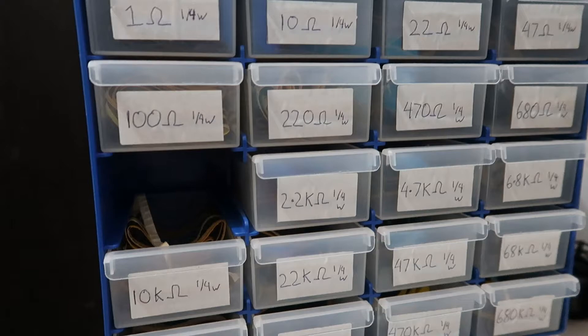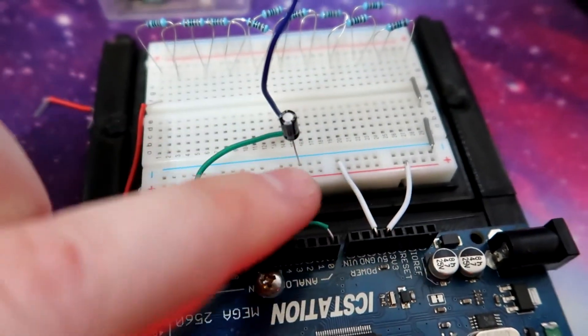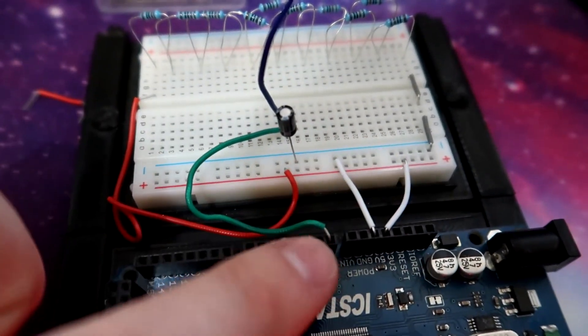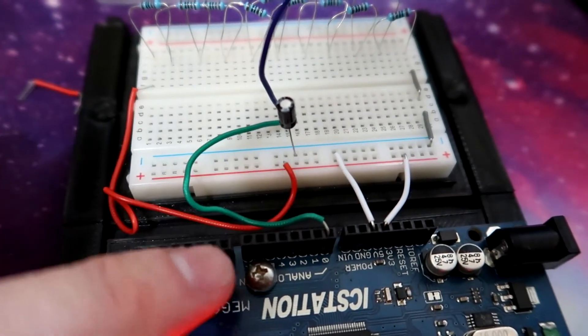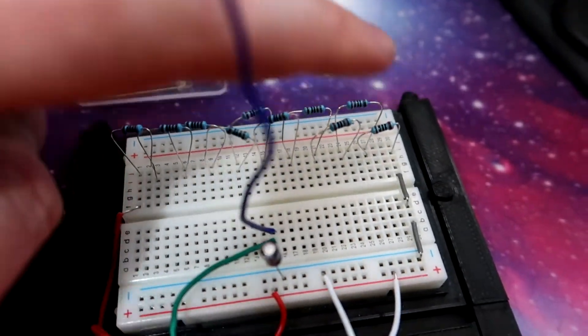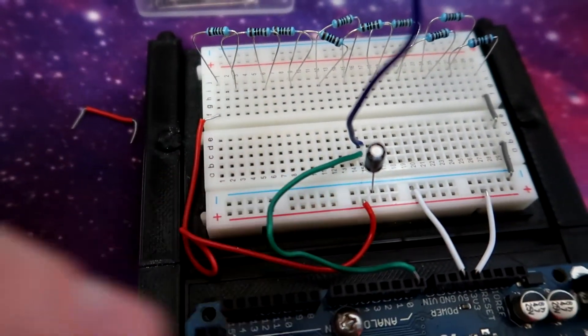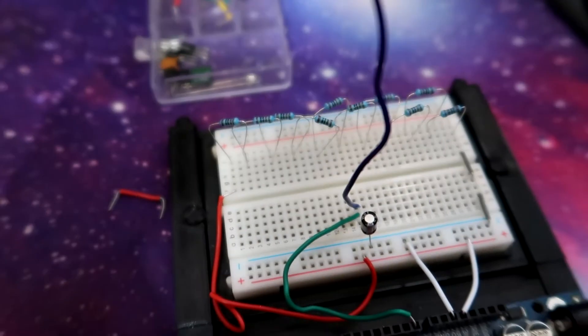Alternatively, I probably wouldn't want to go past 10k ohm as you start to get a very wide range of resistance for the Arduino to pick up. So I've set up the wiring diagram on this breadboard without the actual switches. You can see I've got the 5-volt rail, the ground, my signal pin, and the 5 volts. I've got all the resistors set up basically in series, and I'll explain how this is wired up compared to the actual wiring diagram.